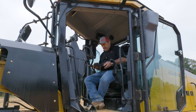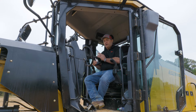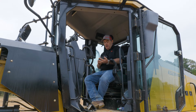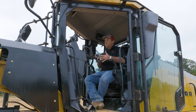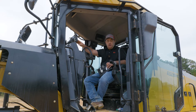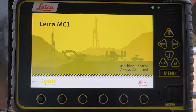One of the first things I'd like to discuss is our panel here. We have a smart docking station and then we have the panel. There are no wires or cables on the back of this. All communication and power is done through induction and infrared communication. We made it simple so the operator can pull this off at the end of the day, put it in his box and go home. All the machine calibration, measure up, and hydraulic settings — everything is stored in the smart docking station. When the operator comes in in the morning, he simply pops the panel on, hits the lock lever, and the green light will come on.